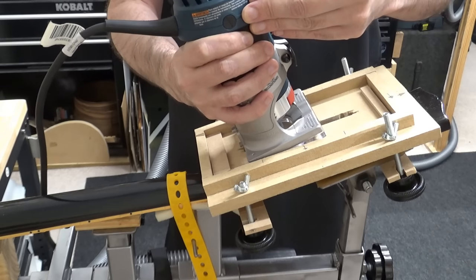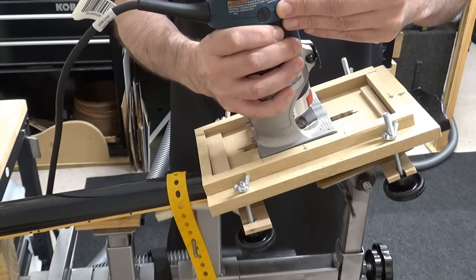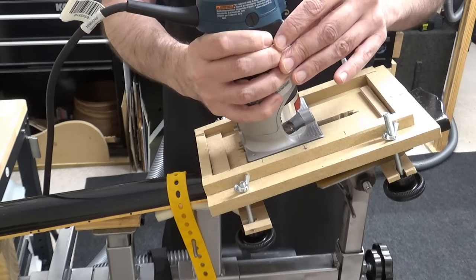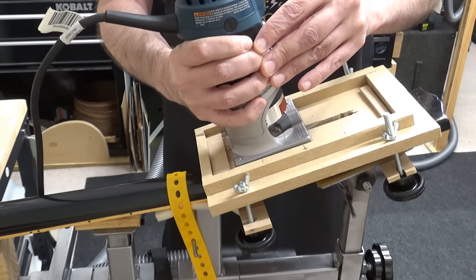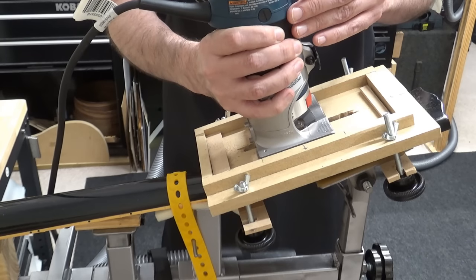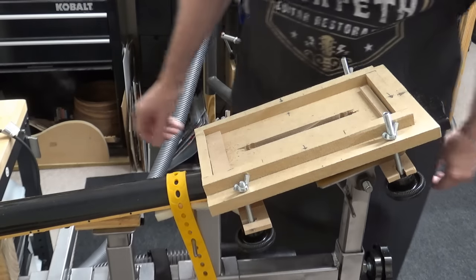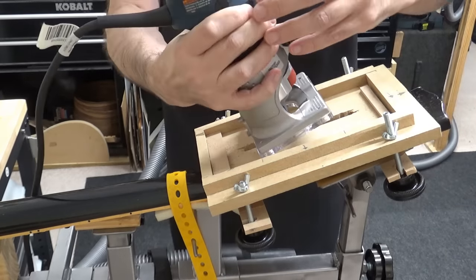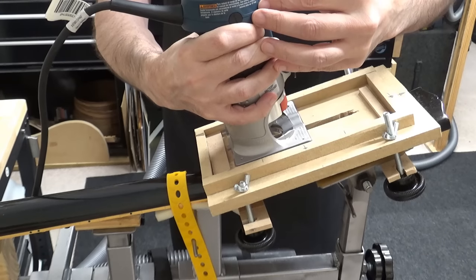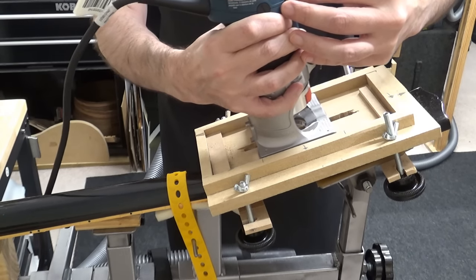Now I'm back over to Doug Propper's guitar workstation and this handy little jig that I made, which is inspired by Ted Woodford's neck spline jig. The difference is the router bit I'm using is only an 1/8-inch cut and it's a quarter-inch shank — the Bosch Colt router. The length of the bit is about two and a half inches. If you want to try this yourself, then you'll know what to buy. The bits come in different arrangements. There's the spiral, which I love — they can be two or three flutes.